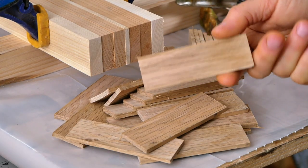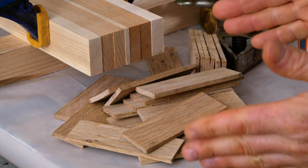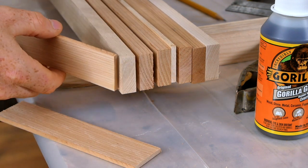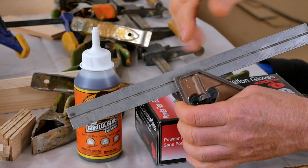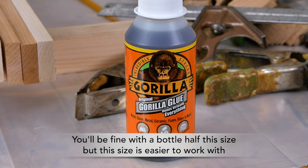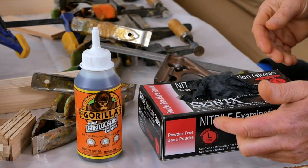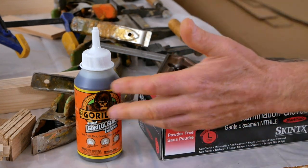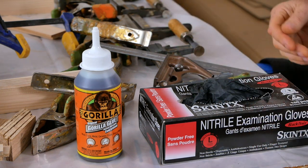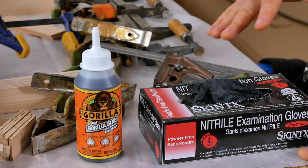I normally make myself about 20 of these pieces out of scrap wood - these are 3/16ths thick by about four inches long, and I usually put about three of those on each blade. I've cut myself a couple of thin spreader sticks that are exactly as wide as the paddle is thick. And then finally I've got a combination square to square up the ends of the paddle, some disposable gloves, and this eight-ounce tube of Gorilla Glue. Anytime you're laminating, it's way better to have too much glue than to run out halfway through. As far as different glue choices, I have always used Gorilla Glue - I like it because it's waterproof, it's flexible, it's relatively strong, and it's easy to work with and it cures quickly. Other people have told me that they have glued up their paddles with Titebond 3 and haven't had a problem with it, so if you do decide to glue up your paddle with Titebond 3, please drop me a line after a couple of years and let me know how that's working out for you.